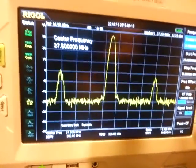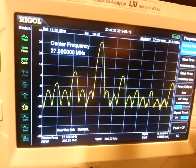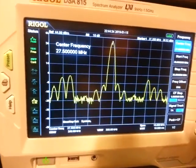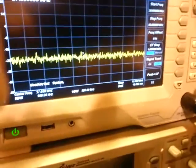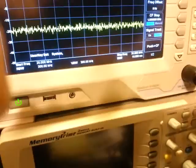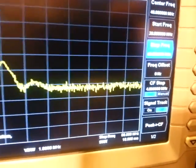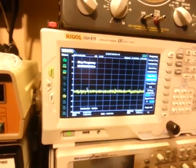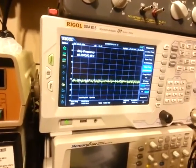I'm not sure — at first when I first saw it, I thought it's a problem in the oscillator circuit, but I really got to pop the cover on this one and take a look. This is a really weird problem. It's not like it's a second harmonic — you know, on band D which is right here, that would be in the 54 megahertz band. So let me move the stop frequency to 60 megahertz, so the right side of the screen now represents 60 megahertz. As you can see, there's actually no spur down at 54 megahertz, which is what you want. All of the extra energy — it's just really weird. I just wanted to document this before I even open this radio up to see what's wrong with it, and then I'll update the video later after I get it figured out and get it fixed.